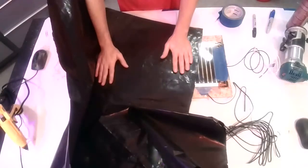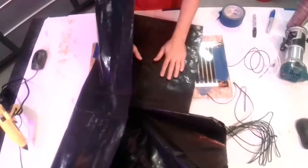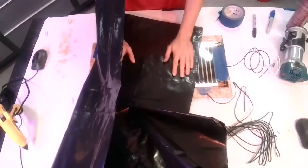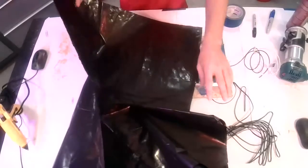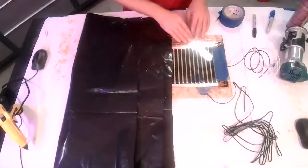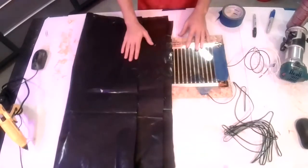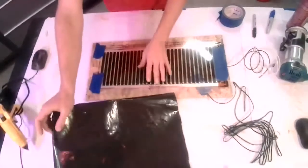If you're in an installation like an RV or something where it's moving a lot, we really recommend gluing the vapor barrier down so it doesn't move too. That'd be a good friction barrier. If it's something more stationary, like tiny homes tend to be, just making sure the heat panels are covered and getting it spot tacked so it's not going to move all around on you is okay too. Depends on what type of flooring you're putting on top.